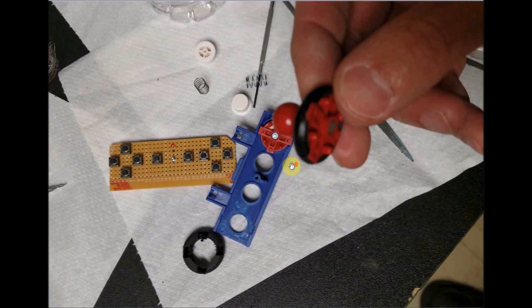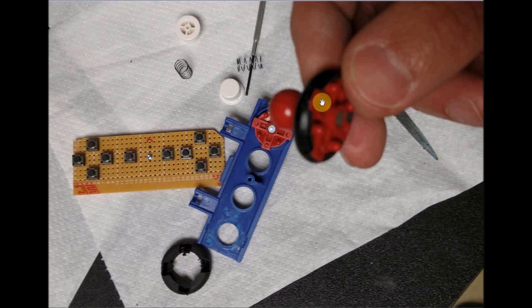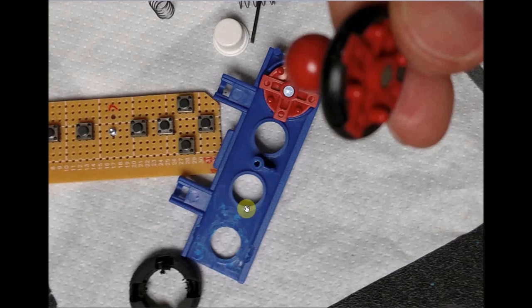You have to keep widening this opening so the joystick sits inside. Now if you have a 3D printer you can just model two joystick areas and print it, but I didn't have one at the time. I was able to leave one pylon, and once you put it in place the other supports will make it solid — when building it it's a little flimsy, but in the unit it'll be nice and solid. I also had to sand down and remove the lips on the buttons, because once the buttons sit above the micro switches those lips would press them down and make them unusable.